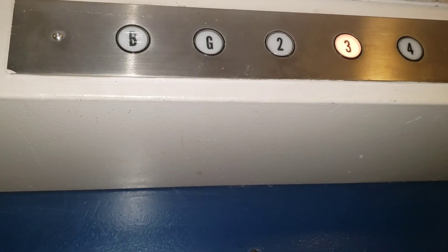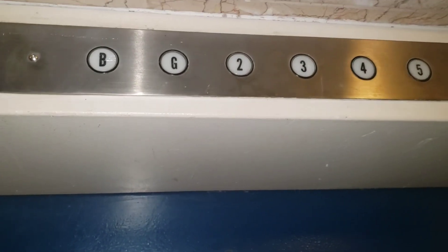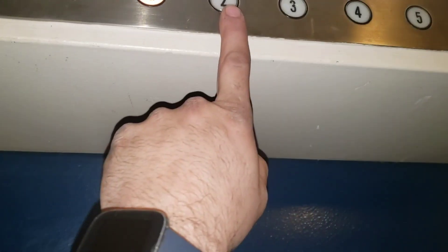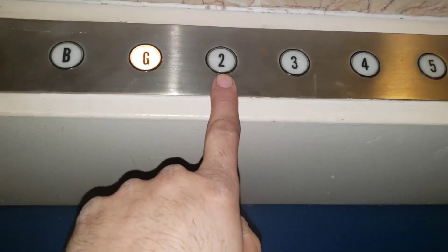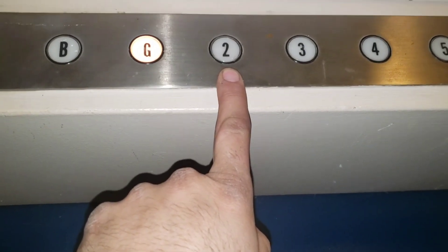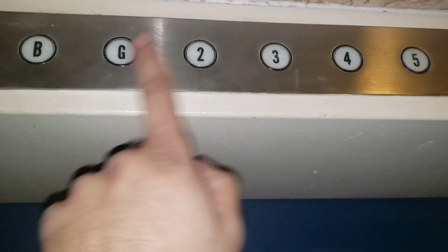It's going to come back down here again. Two is out, and here it is — opens the door and it keeps doing it over and over again. My first guess is that there is a two-call in, and our 2S relay is dead. It can't stop there, so it just keeps going between here and here.